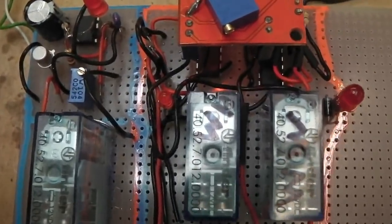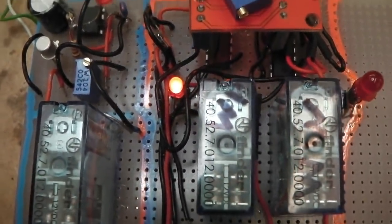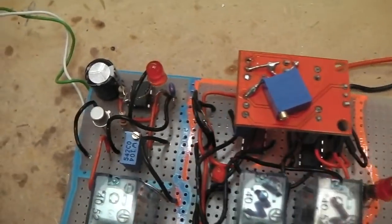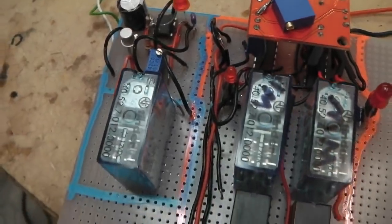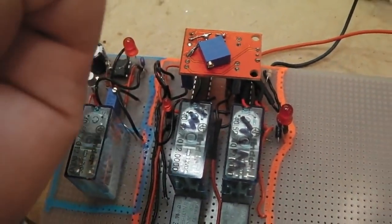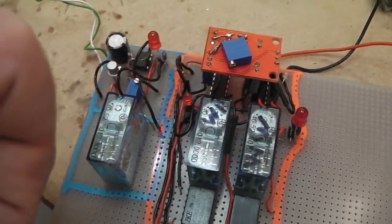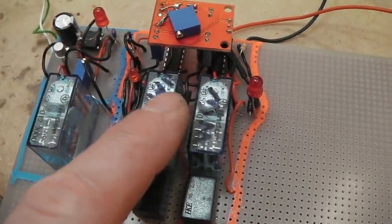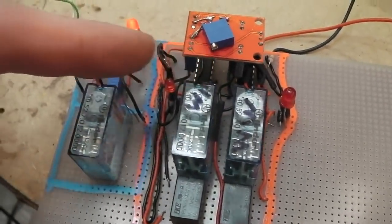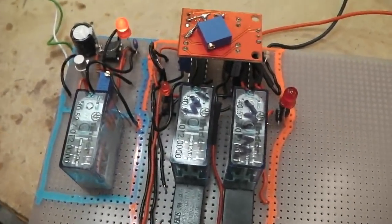And then post wipe any second. There you go. That's a self-contained circuit here, just ticking away. Of course, this is intermittent. That would not be on, because the stalk needs to push up for intermittent, down for the wash cycle if you trigger it. So the wire can never be on both. You can never have power on both those at the same time, because the stalk stops that from happening.